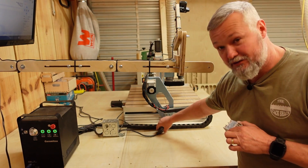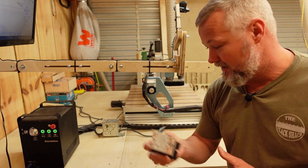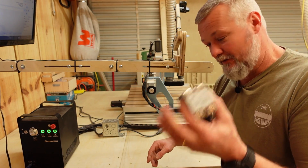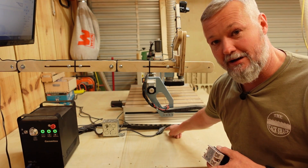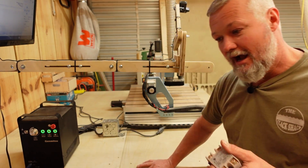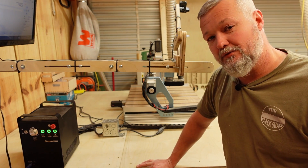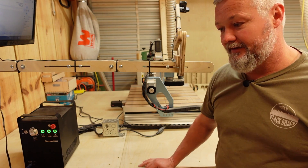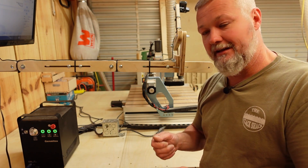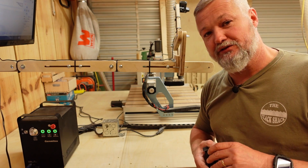The way I went about the wiring: coming out of the electrical box, I bought a six-foot heavy-duty extension cord, cut it, and wired it into the relay using wire nuts and typical household wiring. When the relay engages, it energizes the wire going to the router, which causes the router to come on. When the router turns off, this loses current, the relay disengages, and the router goes off. On the other end of the cable, I'm running a shop vac relay you can buy on Amazon — made for chip extraction vacuums — that is just plug-and-go: plug it into the wall, plug your tool into one outlet, plug your dust collection into the other, and it's automatic. No electrical work or skills needed for that one.